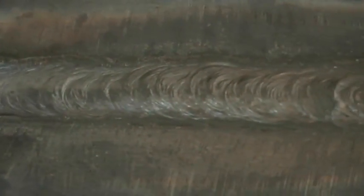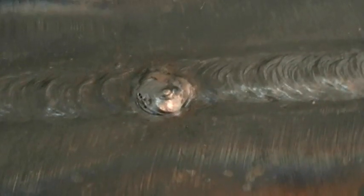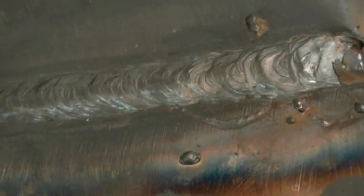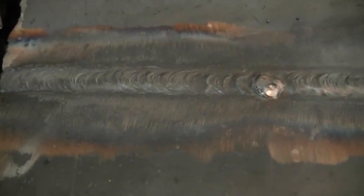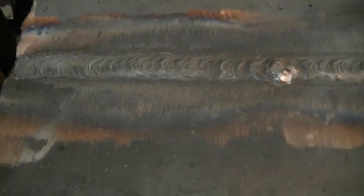Here you can see the nice fine work this unit does. Had a little bobble right there and did a little fill after it — that was on the restart. As you can see, it does make a nice fine puddle, and the only limitation is the welder doing the work himself. So you can get a good idea how this unit welds. It's a fine welding machine — very portable, very compact. With the 60% industrial duty cycle it has, you can keep up with the big boys in a small package.